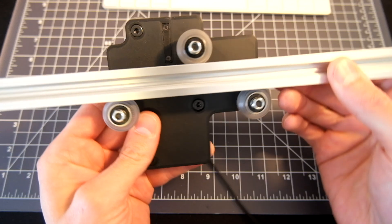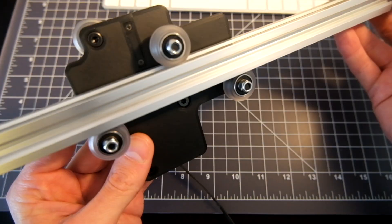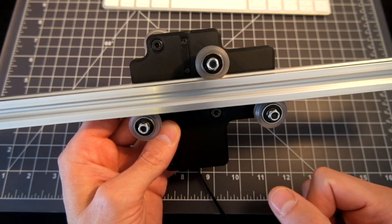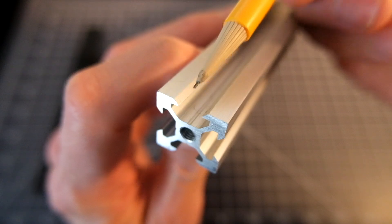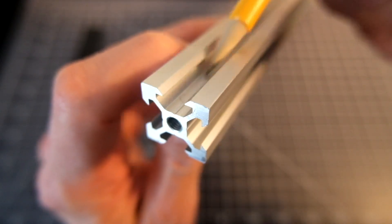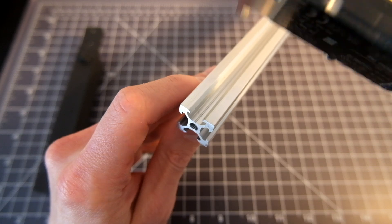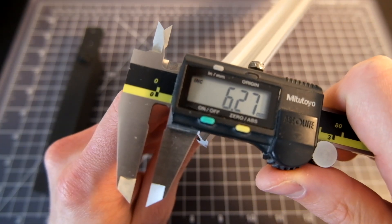When I think about how to achieve smooth motion, my mind immediately goes back to these V-slot wheels. I've been really impressed with just how smooth the motion is on this carriage, and it would be great if I could use something like these wheels on the counterweight if I can. A discreet and clever way to do this would be to mount the wheels to the counterweight so that they align to this interior channel. The wheels would be totally hidden inside of this channel, and the motion would also be super smooth. The constraint here is that the interior of this channel is really narrow — it's less than a quarter of an inch wide — so I need some pretty small bearings if I wanted this to work.